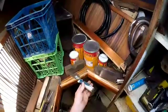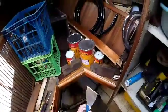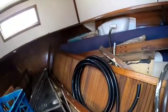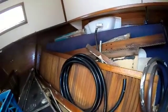This is a great little tool. It's actually built to cop a little bit of a beating. Fairly sturdy handle on it, a good solid edge, and you can sharpen it. If I had this at the start, when I was removing the frame for the door to the bathroom, I probably would have got away with not breaking it. That's going to chew up a lot of time when I go to rebuild the boat. Yeah, when you're doing a demolition on a job like this, you really want to employ as much economy of effort as you can. Like with these screws down here, I could muck around and try and back them out, but I'm going to chisel them off.